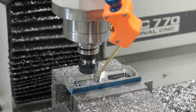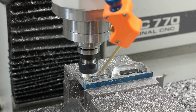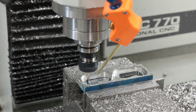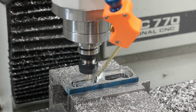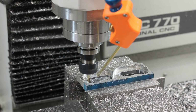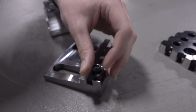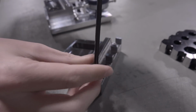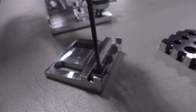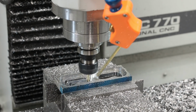Originally, our clamp was actually one solid bar, and this didn't quite give us the clamping power we wanted, and I also hit it with a hammer and it bent in half. But these are actually inspired by the pit bulls we use in our Mod Vise. It's the same idea with the inclined plane along the bottom, so as you screw, it tightens more, and that gave us significantly more clamping power than the bar that I had originally designed did. So that's what we went with, and they worked great.